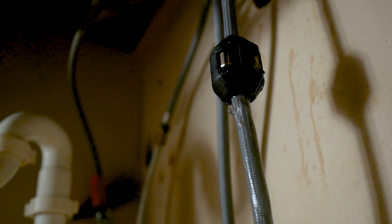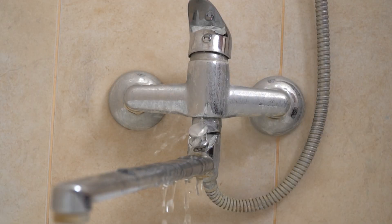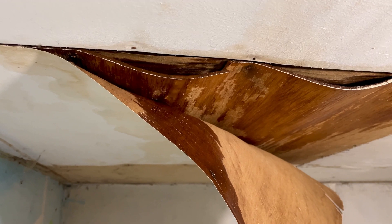What happens with higher pressures and why are they bad? Higher pressures — say 100 pounds per square inch or higher — can do damage to your fixtures, your appliances, and your home. That pressure is not what they're typically designed for; 100 is usually the outer limit. When you're running at pressures higher than that and you blow a seal, you could flood your home. So not only do you have to repair that, you have to repair your home. Very bad.